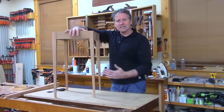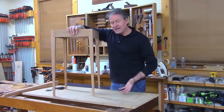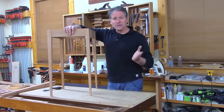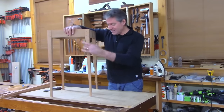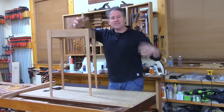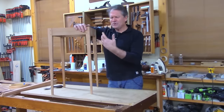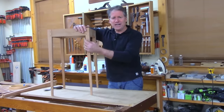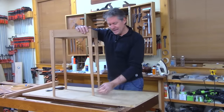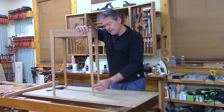This is a simple tapered leg project, but in the past I've done a number of pieces that have been like an upscale or designer version of this table. In fact, in the 18th century, the early federal period, this style leg — this simple tapered leg — was embellished in so many ways that made it just extravagant in many cases, where you would have many inlays and probably most popular the bellflower that was shaded in hot sand, with beautiful lines down and arcing little inlay lines. And then quite often you'd have a cuffed foot with a kind of contrasting veneer down there.